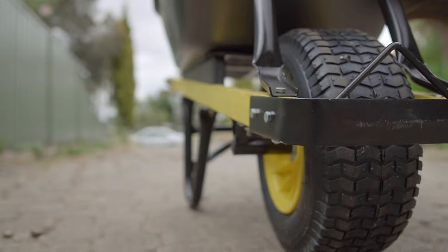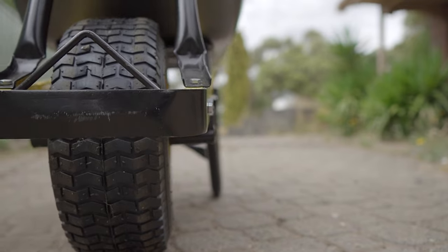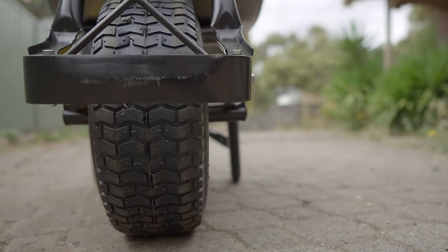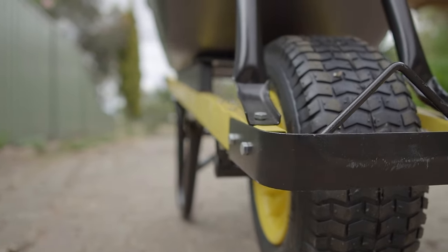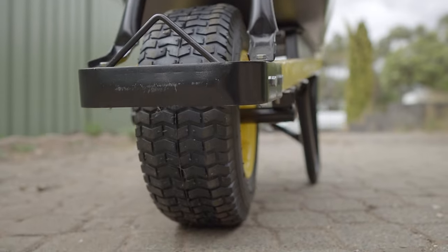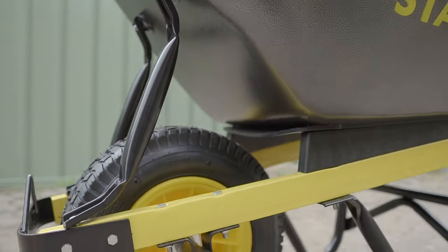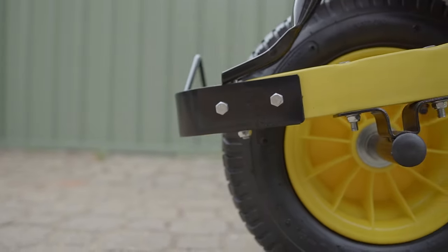The wheels come in a variety of sizes and thicknesses, with the current trend being the extra wide tires. Many tires you can get with current wheelbarrows are now much wider and flatter compared to the old traditional rounded tires. This gives them more stability when moving the wheelbarrow, as the wider tire helps keep it centered and also helps prevent bogging down in softer ground when fully loaded. The thicker tire does give less maneuverability though, so wheelbarrows designed for agile tradespeople tend to have the older rounder style tires. Many of the current wider tires now come with a four ply thickness to help prevent punctures — check to see if the supplied tires are four ply.